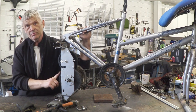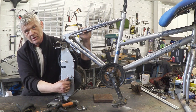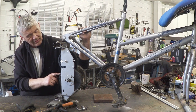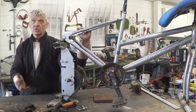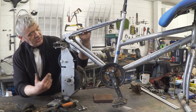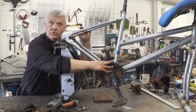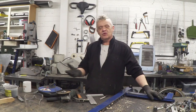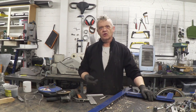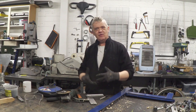So we've got two options on taking off the drive. We've got a spare point here that we can connect something to, and then we've got this point here that we previously put the toothed belt on. Either of those is going to be good for taking the drive off. We get the gear ratio that we want — high speed here for a low speed there. So now we've got the frame done, we've got the transmission done, we've got one output point which is the one-to-one gear ratio, and now we want to make the other output point.